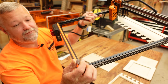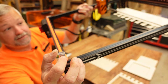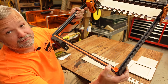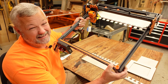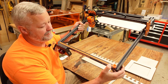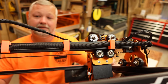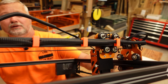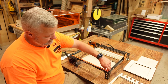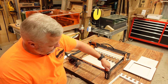What I've done here is created this little holder for that focus tool — it's very critical that you have it, but it's a little pain to keep up with without a place to put it, so I created a little nest for it. I've also decided it needed a little color up front, so I created a little insert here — this is actually just a file off Thingiverse, so you can go find those extrusion inserts there. The other part I designed are these little twist clips that twist into the extrusion, and when you put it in the extrusion and twist it, it makes a little clip to hold the wires. All of these pieces insert simply like this — rotate 90 degrees and it pops out.